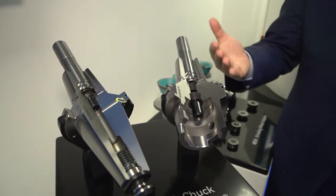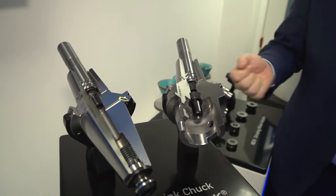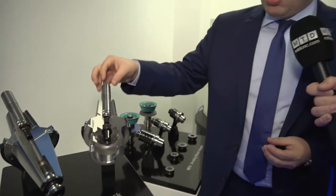You can choose your own regular cutting tool maker and geometry for your own application. Why does SafeLock make sense? Because nowadays cutting tool makers are developing the latest and greatest geometries ground to 3 micron. They have special edge prep and all these features to bring 10-20% better productivity and high precision. But when it comes to tool clamping, customers are still doing the same as 50 years ago — pushing the cutting tool out of center and making a 4-flute cutting tool behave like a 2-flute.